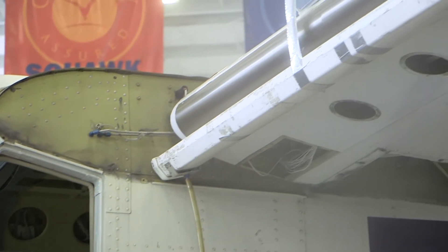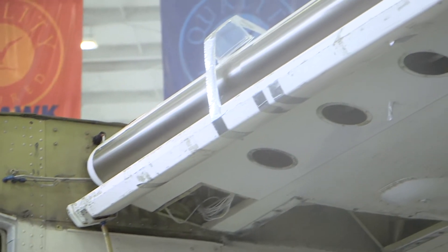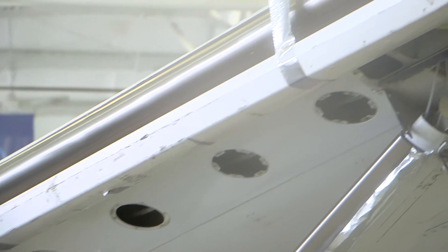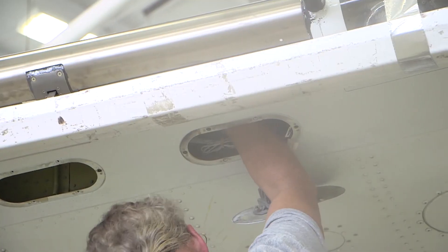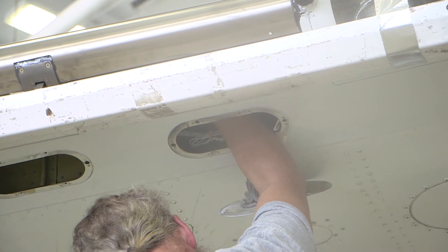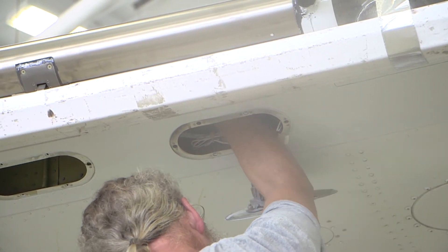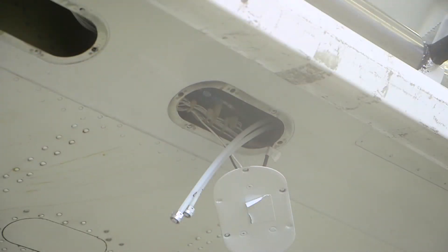Attach the fabricated fluid collector system below the area of the panel that will be purged. The following steps demonstrate a panel purge on the left outboard wing panel. Disconnect the fluid inlet tube from the panel fitting. Warning: before the components of the TKS system are disconnected, slowly loosen the coupling connected to the component to be removed, because it is possible that high pressure is still in the system.